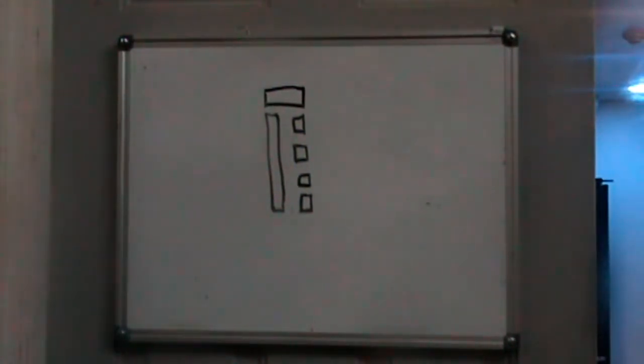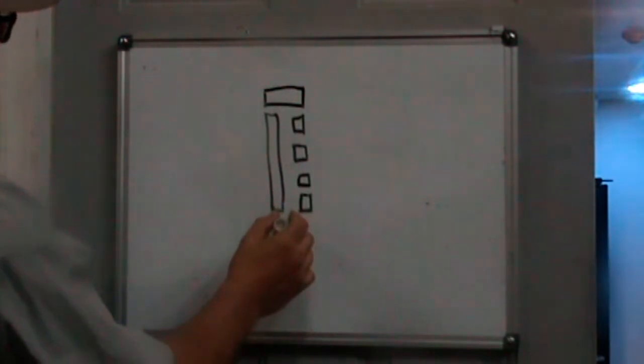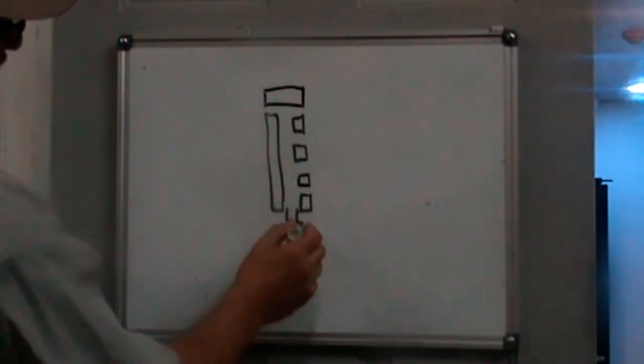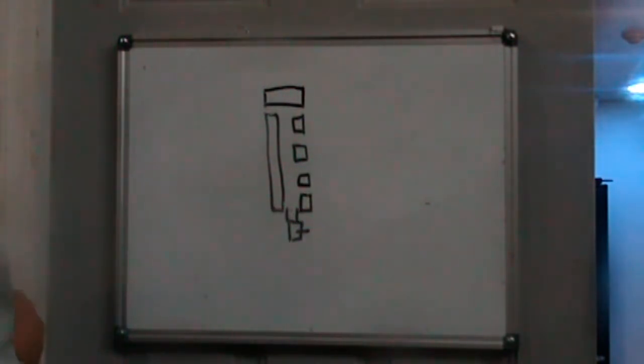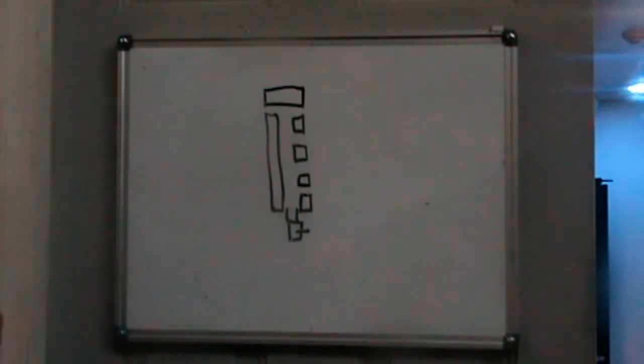That's what I have. All right. It was drilled up this way, and the plan is, and still is, to put a ball valve right here on the bottom of this on a nipple, a little handle. So if I ever do get any moisture past everything else into the manifold, I can drain it right there. I hope I never get any moisture in here.